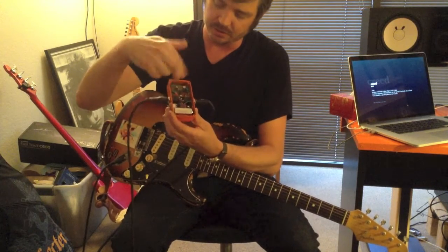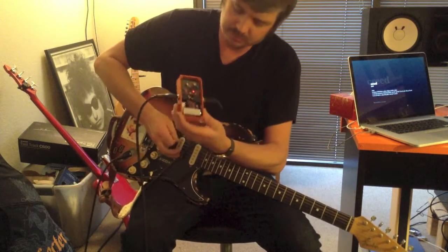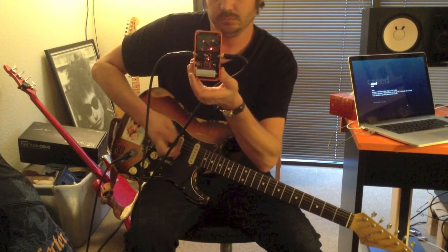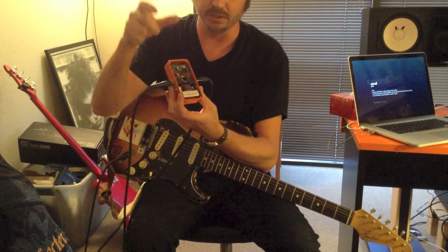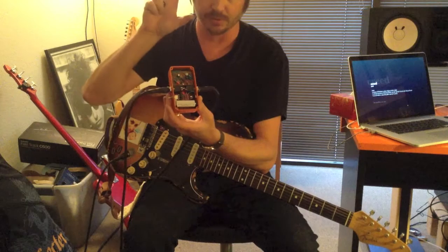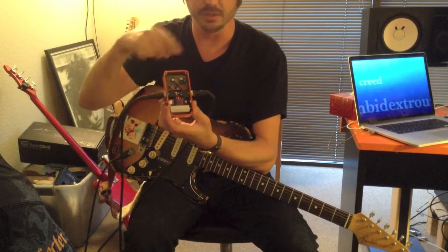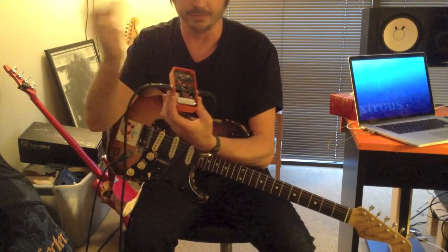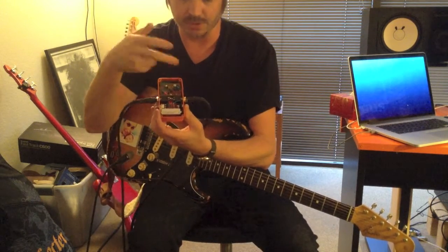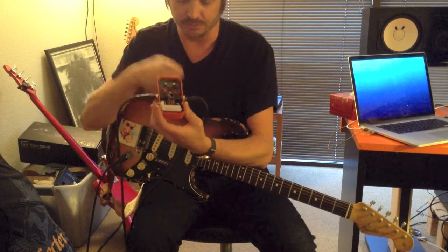When you're using this, you can actually see the clipping happen. That LED lights up — and that's not just a neat little thing. It actually helps clip the signal and create distortion. When you use an LED, it tends to have sort of a more spanky bottom end. I'm not the first to do this; lots of pedals use LEDs for clippers, but on this one you can see the visual of it.